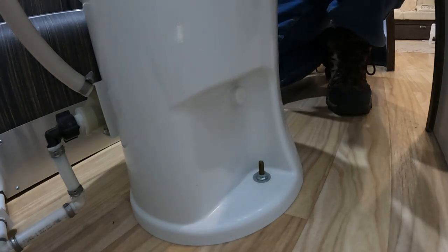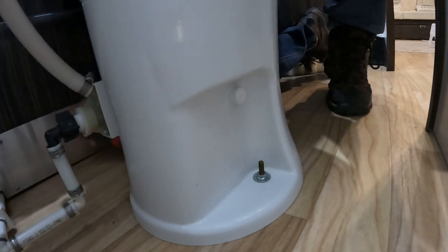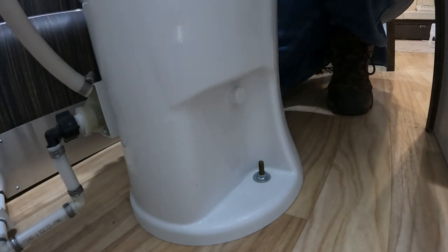Cap is off. Stand by while I take the other side off. Caps are off. As a note, if your water was on — city water — you could turn it off. There is a valve here to turn water off to the toilet. What I've discovered is this valve is kind of in backwards. It does not turn this way to close, but it does go that way to close, which doesn't do much good here. It will turn a little bit, but we're not going to worry about it since the water is off. If we had an emergency, that might come into play though.